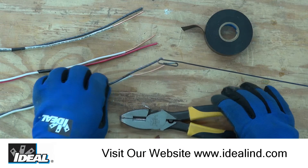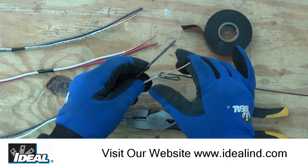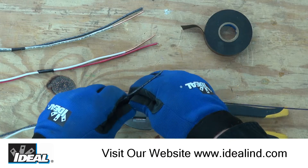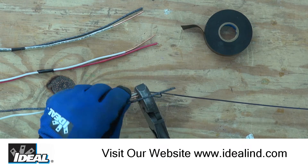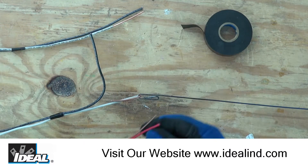What we're going to do here is go ahead and attach the individual neutral wires to the hook and fold them over themselves. Then I'm going to use my linesman's pliers and give that a good squeeze to minimize the size of it, and get that hot wire out of my way.